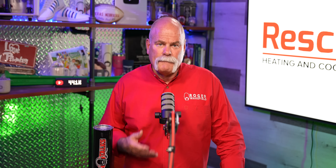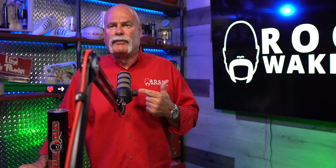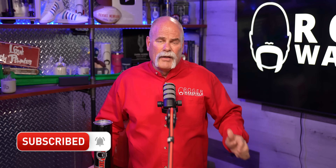If you have to put fittings in the correct ranking order of stability, pressure, and quality, you'd look at brazed fittings first, soldered fittings next, then Quick Fitting, then a press fitting, and last would be shark bite. How do we go about saving money on jobs in the future? If we can find a product that saves us labor and saves us money on materials, that's going to be a win-win for the consumer, the customer, and the plumber. I still think — and even the people at Quick Fitting agree — that soldering and brazing are fantastic. They are now the next best thing. Thank you to Quick Fitting for sponsoring this and taking me up there to show me that an old dog can learn new tricks.